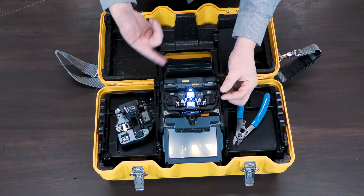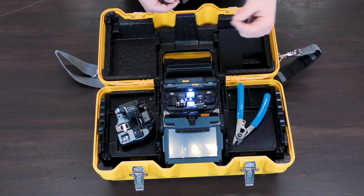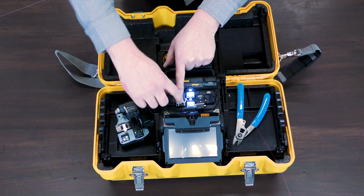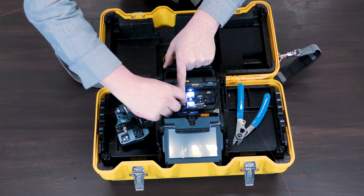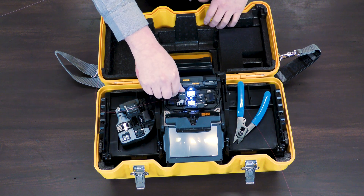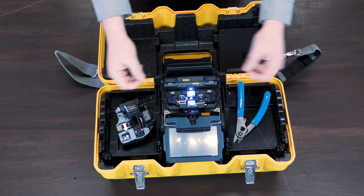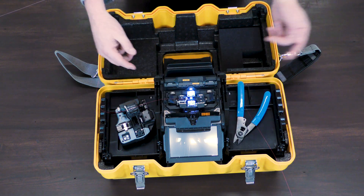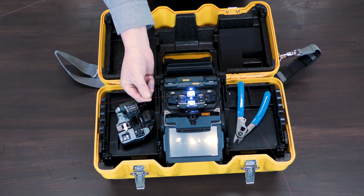After you do a burn, open that clip and you would have your spliced fiber. But much like the 90S, this slides over, which allows you to open this clip while your fiber stays in place. So if you're splicing a fiber that has a lot of tension on it, you're sometimes worried about that splice popping up and snapping — here you can manually control that splice.